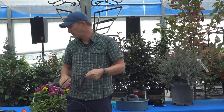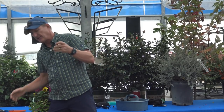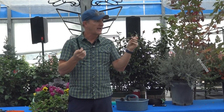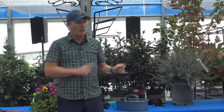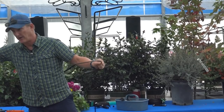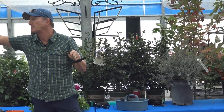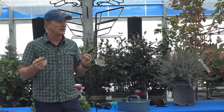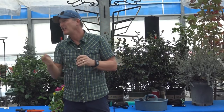I'm actually stunned how many emitters you can have on spaghetti tubing and water still comes out. You'll know you've gone too far when you turn the drip system on and water comes out of the near emitters but not the ones at the end of the line. That means you don't have enough pressure. In that case, take more distribution line and run it closer to that tree, shrub, or rose garden.